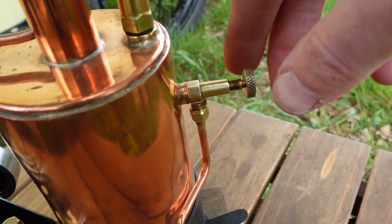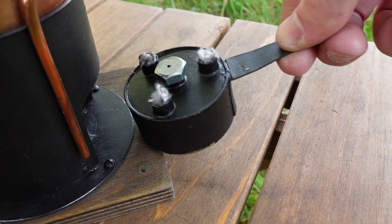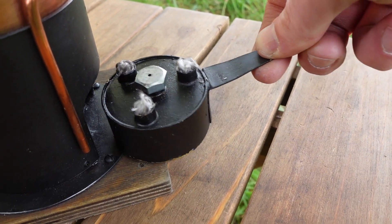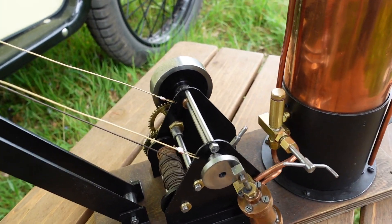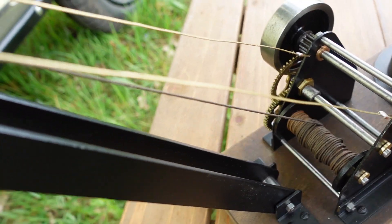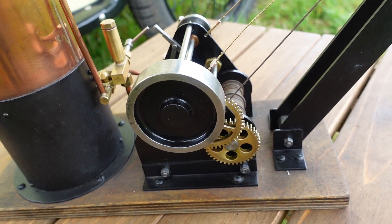On the top of our very nice copper boiler we have our safety valve, which is set to blow off at 30 psi. Then we have our blow-down water level check valve. At the bottom we have our methylated spirit burner — as you can see it's got three wicks, and I use a ceramic wick material which lasts a lot longer than the cotton type. As we go around to the front, we have the main winch for winching our loads up and down, and then up the jib to the top where you can see our hook. Round the other side you've got the main flywheel and also the gears that drive the winch.